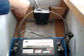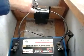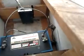bang, and that's what happened with the first one. I pulled it out, and I think I didn't have this one initially. I only had the one battery just in here. And I pulled it out, and I slid it over this way, and the handle snapped and came down on top of that. So your battery select switch there, which has multiple positions, is stuck on one because it's actually soldered in solid, because it slammed the battery, the charge controller cover, which is sheet metal, slammed that down quite a bit, about 3/4 of an inch or something, and wrecked the switch.